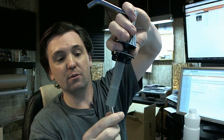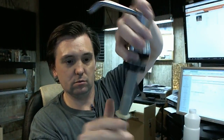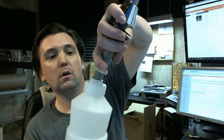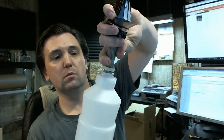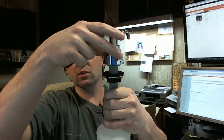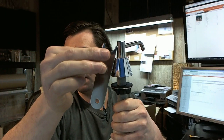Your fill tube is sticking down like this — I just haven't pushed it over the nipple that's inside. You'll thread the small plastic hex nut up first, then the bottle — the soap reservoir — gets threaded on. The hose sticks through and that gets threaded onto the threaded post. Then your hex nut comes down and you turn those two in opposite directions for a tight installation. The other part I didn't show you was the spanner wrench, which is for tightening the top chrome plated escutcheon down onto the threaded assembly below.